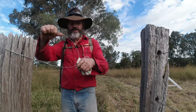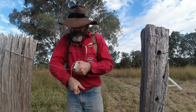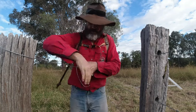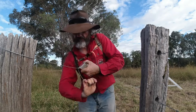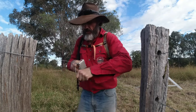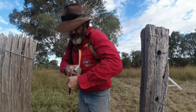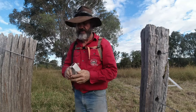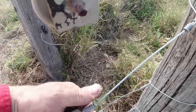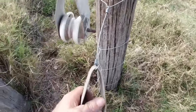Nothing grand about this knot. I'm just going to go straight round, straight down the bottom, make your crank handle, 90 degrees, keep it tight all the way around. That's the secret to getting tight loops — pressure on the crank handle at all times. Round — that's three, four, five, one more, six. Now to break it off, that crank handle, you just turn in the opposite direction, and then just go in the opposite direction to what you're just cranking. There it goes — snaps off. Bring you guys in for a closer look. Have a look how neat and tidy that is. No sharp edges on any of those where it's broke off. That way nothing can catch themselves on it or scratch it. Nice tight D. Perfect for a temporary fence.